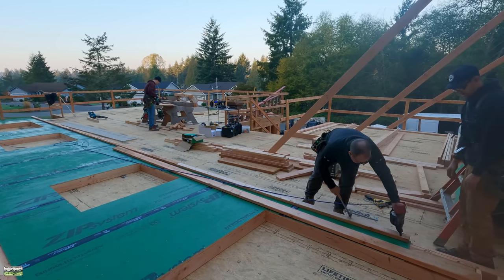Now that still allows us to square up the soffit. Since Kyle cut this right on the money, you can see I'm hanging out over here, so we need to kind of crank it that way. Yeah, we're right on the money. Now go through and nail it 12 inches on center at the bottom. I don't have to move it? Correct. Go 12 inches on center as you walk.